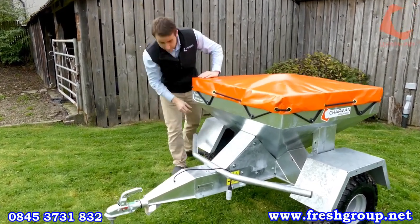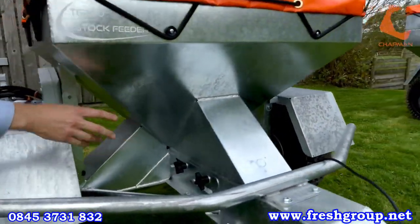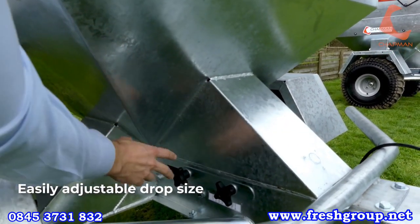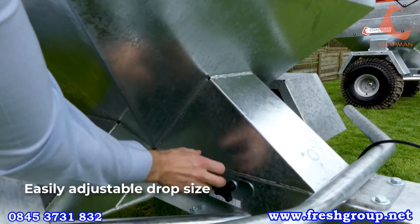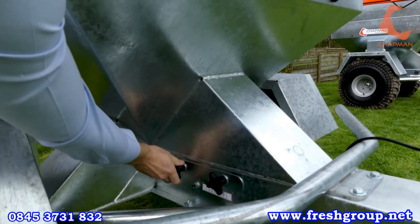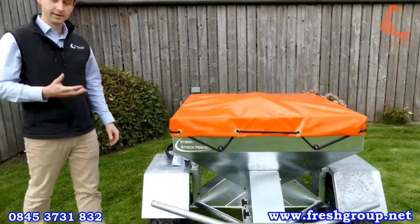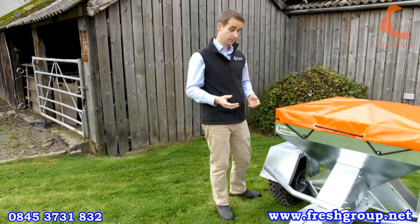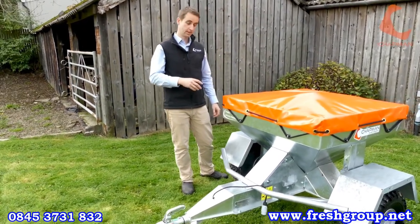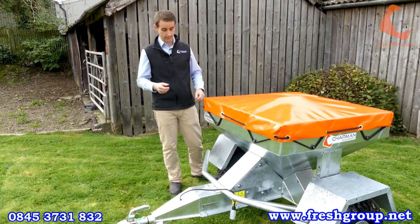You can see the adjustment mechanism on these machines. Depending on the feed you're using, they'll deposit between 0.5 and 2 kilos per drop, depending on what you calibrate them as. To calibrate, you loosen the two thumb wheels, slide this plate forwards or back, and tighten up when you get to the desired setting. Customers typically set it to an easy multiple — two pounds or two kilos — so they know how many drops they need for varying numbers of cattle or sheep in different fields.